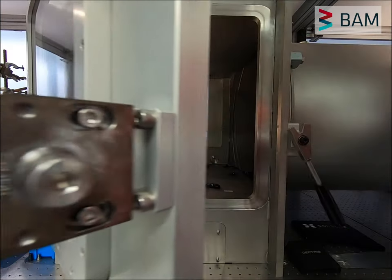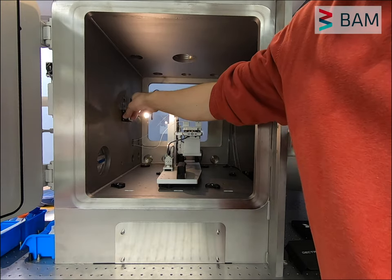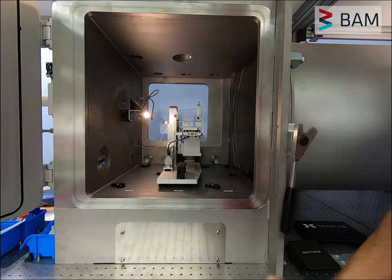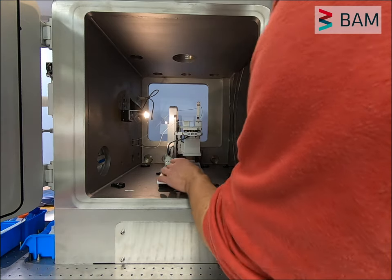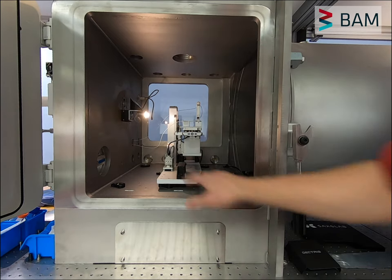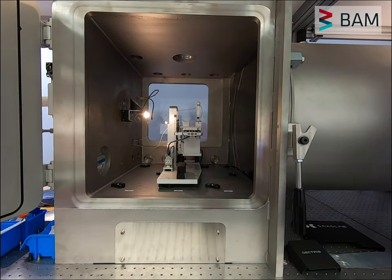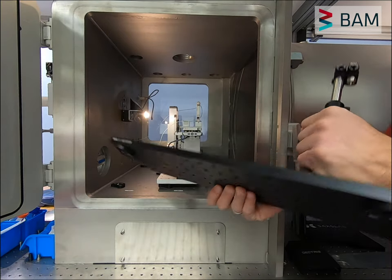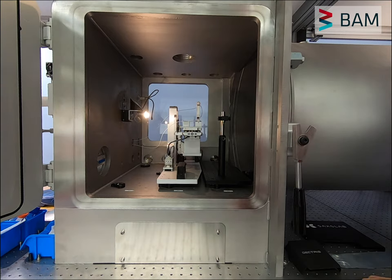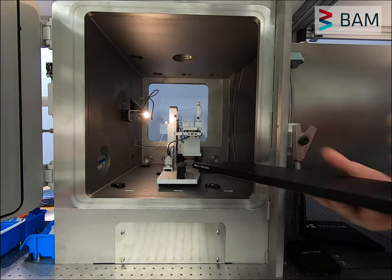So let's open up the sample chamber. Inside the sample chamber we have a couple of interesting things. First of all we have a camera which looks directly onto the sample position — there's a hole in this mirror so we can look exactly down the X-ray beam. We also have everything in this chamber mounted on kinematic feet, so motor stages like this are quickly interchangeable with other setups that we have. If we want to put in a different setup, say a tensile stage or whatever, we can mount them on these standard plates, which I've described on my website, and basically just clip them in place.